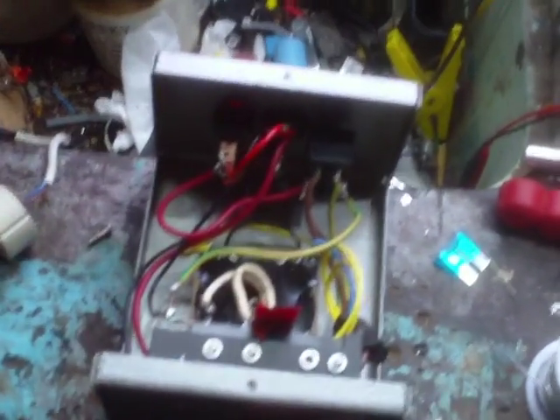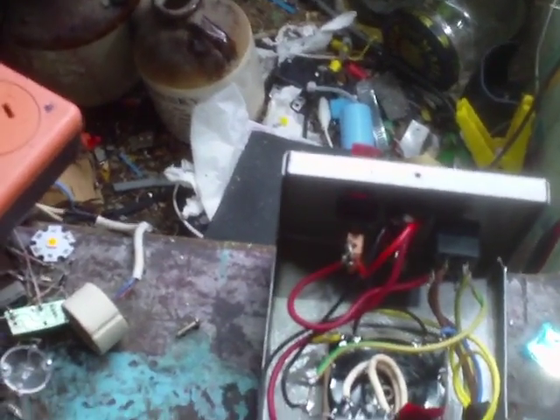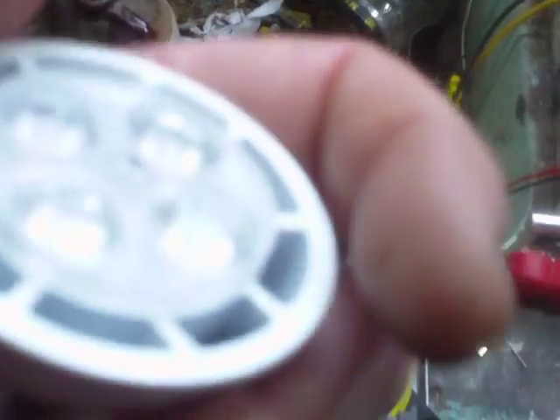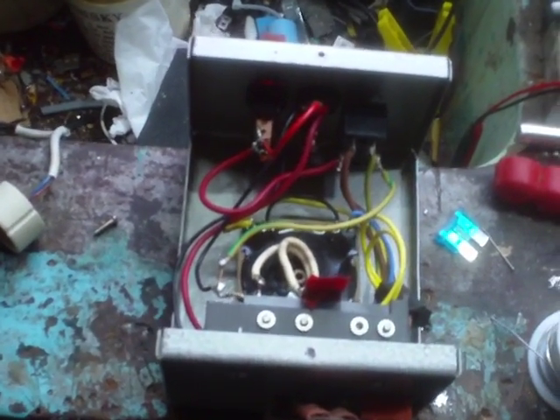This basically means I've preserved the standard operation of the sock light that I'm familiar with and kind of like, and don't see any reason for two lights on at once. It had to be this way in the original configuration because that inverter was not going to be able to run the two bulbs properly at once, but now I guess I could run them both — but I don't want to, so that's basically that. I'm just going to case it back up, take it in the room and see if I haven't created some nasty heinous fault. Once it proves that works, screw the socket back up on the wall, fit the new LED bulb — and there we go. It's quite a chunky heavy thing, six and a half watts, so it's not exactly the most economical LED bulb, but I could always change it for a different MR16 later on. I think it's a pretty good bulb.